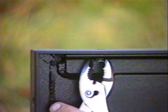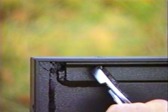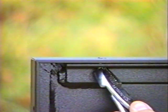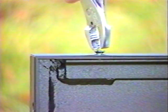On the back side of the frame, use pliers to pinch the 4 prongs of the rivet together. This allows the rivet to be backed out of the hole. Push or tap the bottom of the rivet to lift the countersunk head, and using pliers, carefully grasp the head and pull the rivet out.